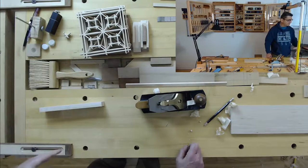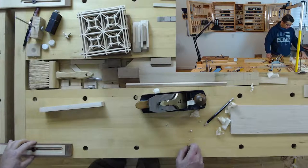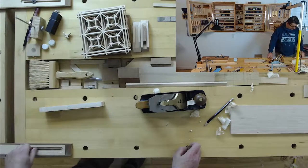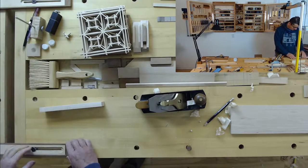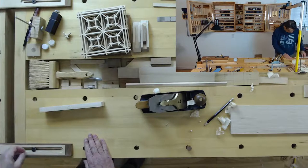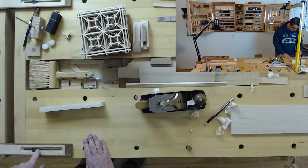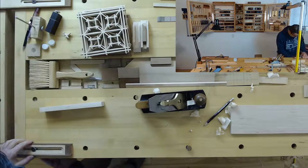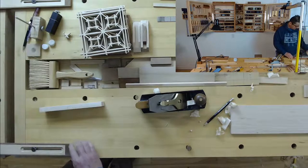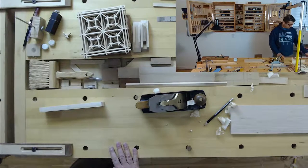And I have it on both my workbenches. They're both similar workbenches. You notice that they're loose. This one isn't so much. So you can almost finger tighten them. And the bolt that prevents it from rising and keeps it sliding works with an inset nut into the bench attached through the bottom, so the whole assembly can be removed, and it's only sitting in a dowel at the end here, at the actual face of the end vise, so the twin screw vise job.